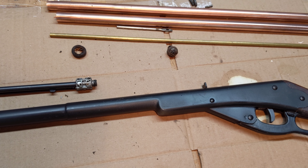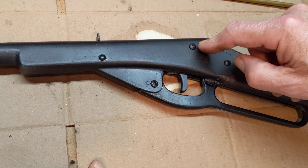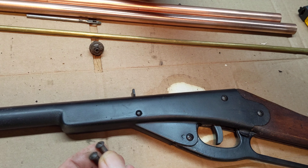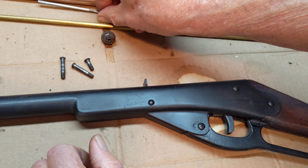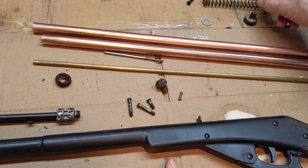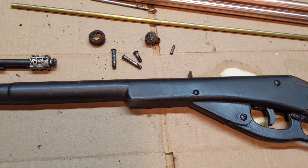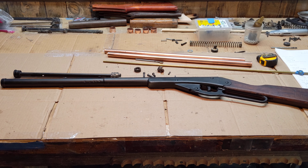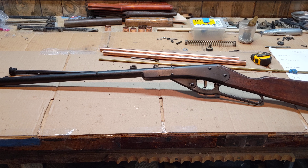Get the gun back together — she's running fine. I am going to pull the Phillips screws that we used for installation ballistics testing because it's just easier to get in and get out than the factory screws, but the factory screws themselves are not in bad shape. These are originals, so they'll be reinstalled in the gun before it heads back to its home, along with the broken bits and pieces that came with the gun — in case the owner gets nostalgic about the old leather seal. You can make fairly inexpensive tools to get leather seals out without a hell of a lot of trouble and get these old war horses back up and running. Over 300 feet a second on this little rascal, a 155.